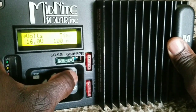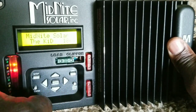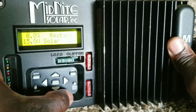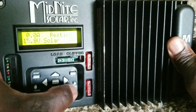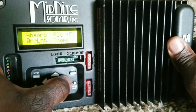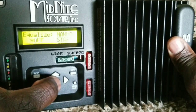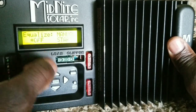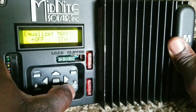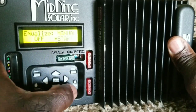I'm already used to the Midnight Classic — you have to push the center button to save, and there's a flashing light to confirm. Back in the menu: set points, temperature compensation, equalizing — set equalization to off. If you want to equalize, you can enable it and start equalization from here.